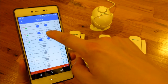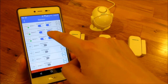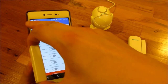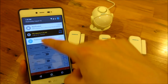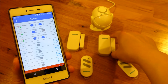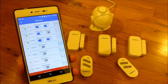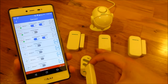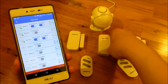The push button controls whether you get a notification for that sensor. For example, with push enabled on the middle sensor and the alarm set, I got a notification saying 'alarm 2 alarmed.' When I turn off the push notification and trigger it again, the alarm activates but no phone notification is sent. The control switch enables or disables the sensor itself — when I turn off the control switch for the second sensor, the alarm doesn't trigger for that sensor at all.